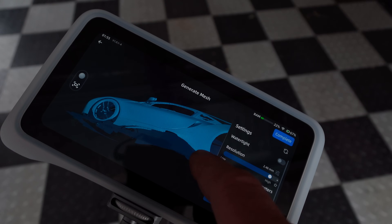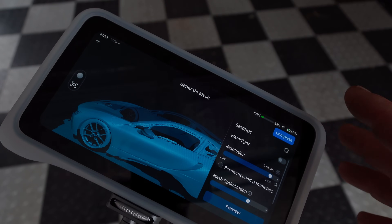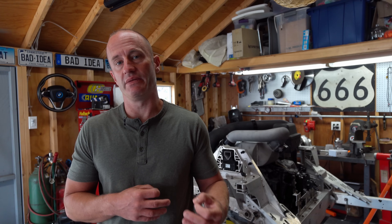Let's get this onto the laptop and get some better video capture. Unlike the Einstar, you're not able to set the point cloud resolution at the start of the project. You just start scanning, and it will automatically adjust the resolution based on how big the point cloud is. If you're scanning a smaller part like the oil filter adapter, it's going to limit the max resolution to about 0.63 millimeters. On the car body, it was limiting the resolution to about 2.5 millimeters, which is perfectly fine on something that big — more than enough resolution to get a reasonable fitment for something like a body kit.